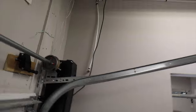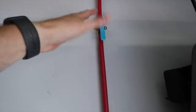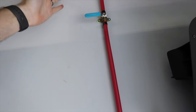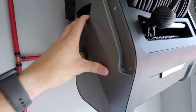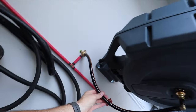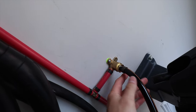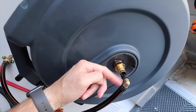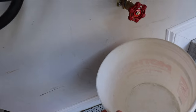It pops through the wall and back through on this side, and I have another shutoff — really more for convenience, or if I notice a leak I can just turn this off and there's no pressure. This comes down to a T and I have pressure in this always. I actually used the hose that came with this — I just cut it and used the PEX tubing connections and fittings. I cut it in half and attached everything in the middle. Then I continue down to a bucket filler.